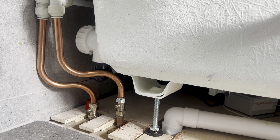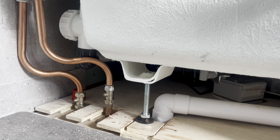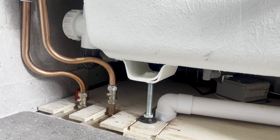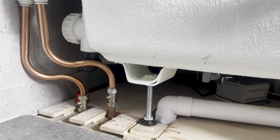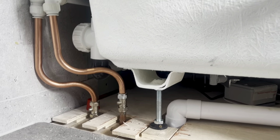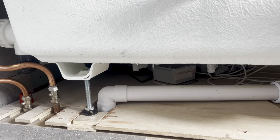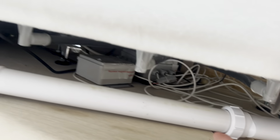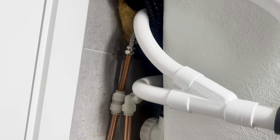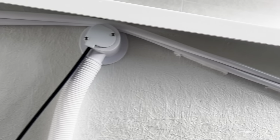So the reason why it's been done like that, with the pump there and the blower the other side, is because these are hollow walls, and you can simply go through the wall in case of emergency for access. And add a vent on this wall and on the internal wall just through there. And we're gonna have some vent going across here, just so there's enough ventilation underneath, because as you can see under there, they've packed insulation under there and around there to lower the vibrations as a precaution, although not everyone does that. It's not really needed, but they've wanted to go extra on it.